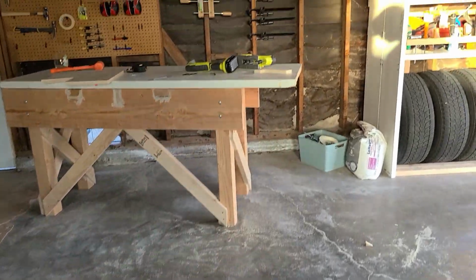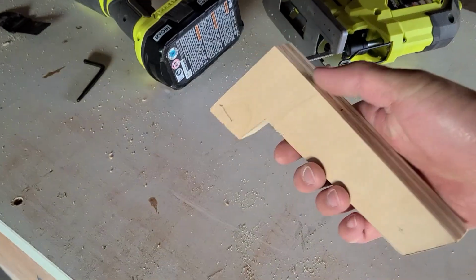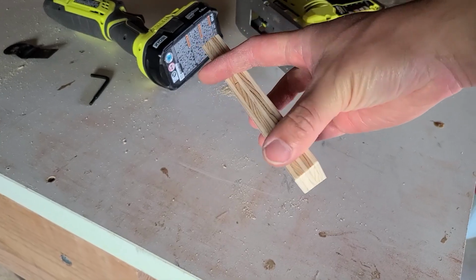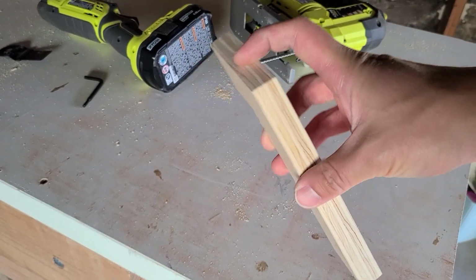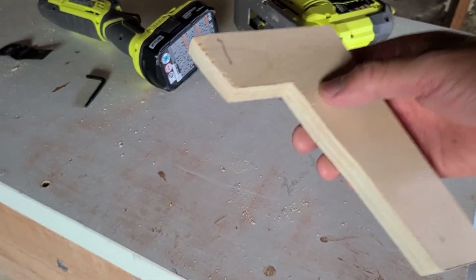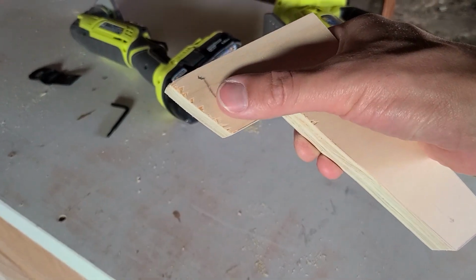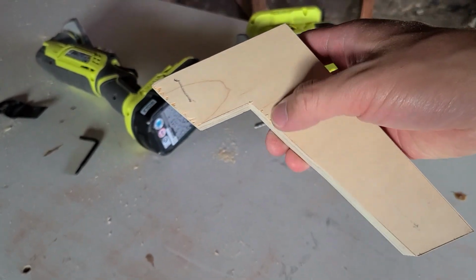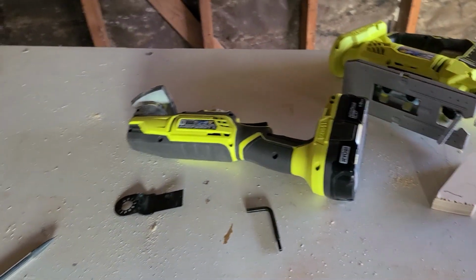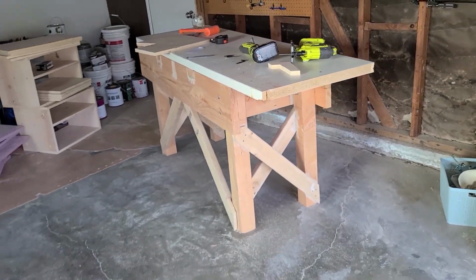I got one of the legs made. The front, I will still use the circular saw to cut because it has that fine tooth blade, same as the top and bottom. But the back will need the jigsaw, and it has a lot of tear out. But it's in the back so no one will see it. With a little bit of sanding, it does look okay. I am going to do that 7 more times.